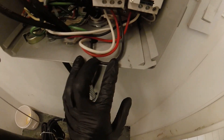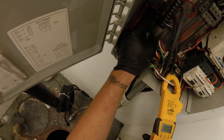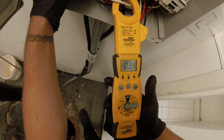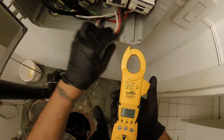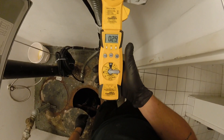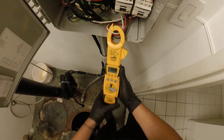Our power is back on. This is one of the pumps that's already in there — I just want to see how many amps it runs on. 3.2 amps, 3.4, 3.3 — alright. Now I just want to test the amps on the pump I just changed. I'll manually start that, just flick it. I can hear it running. Sounds good — got about 3 amps. I'd say that's okay.